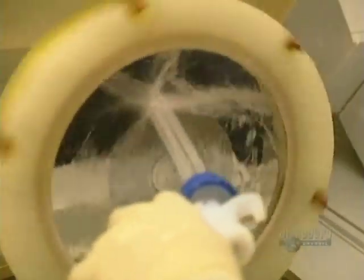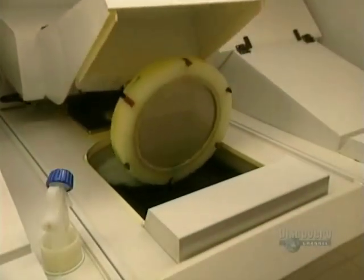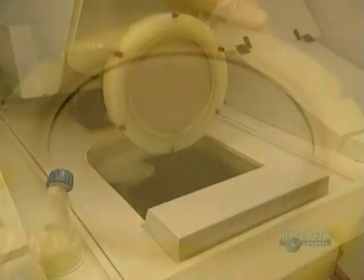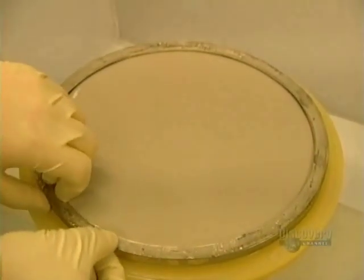The disc is placed in metal coating equipment. The next step consists of applying a thin coating of nickel and vanadium. This electroforming process results in the master from which discs will be made. The etched glass is immersed in a chemical solution for 70 minutes. Then the plated piece is removed, thus obtaining a die.